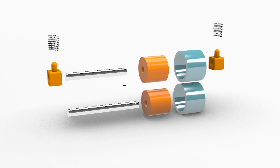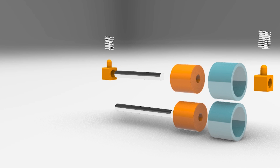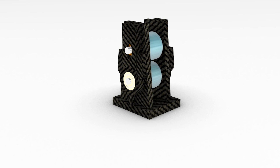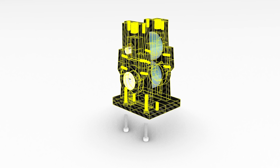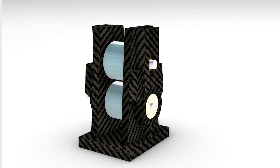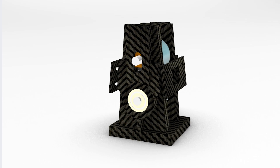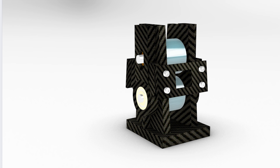In 3D I made an explosion graphic where you can see how it looks without the frame and how you have to bring it together — you can also see the springs which we'll add later. I hope it helps you to see everything better in 3D. To give it more stability, we connect the second frame part to the first frame part with screws coming from the bottom, going through the first frame. All the threads are already inside the STLs, but you have to re-cut them with your inner thread tool so they are sharp enough and the screws will fit.